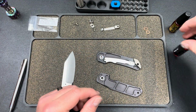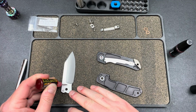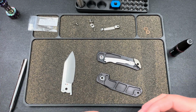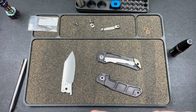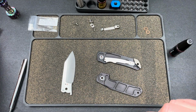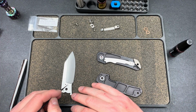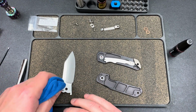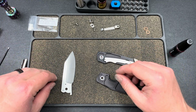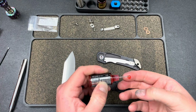So I'm going to grab these. I'll just take the KPL Heavy right away, put it on the detent track. And again, I can go a little heavier on that if I want to, because I'm not going to have an issue with buildup in the detent hole, but I still am not crazy about having so much on there. So there we go. All right. And then the bearings will get their oil.